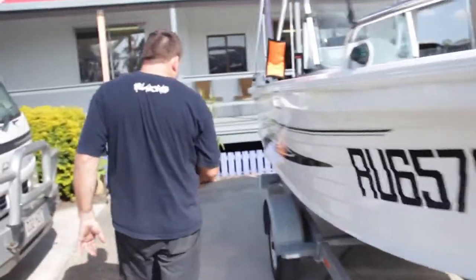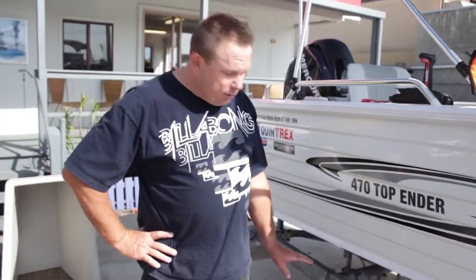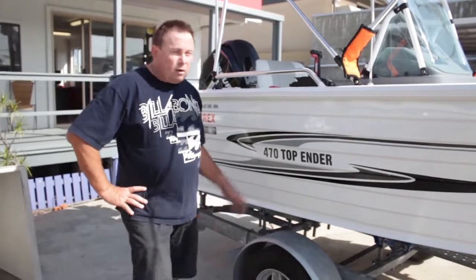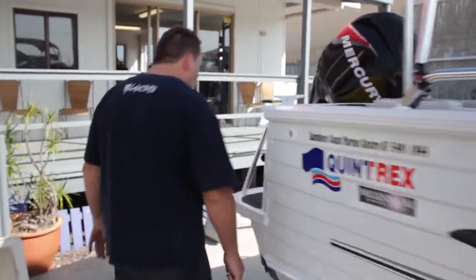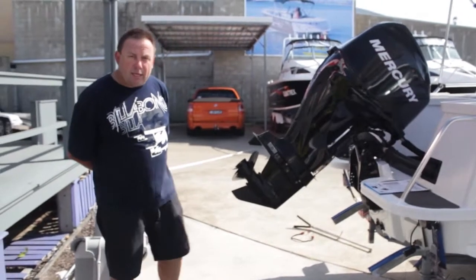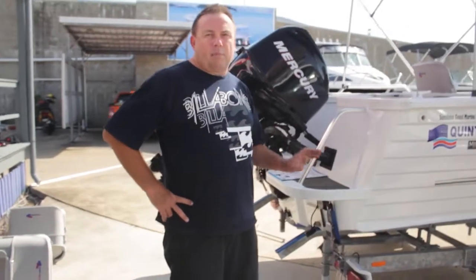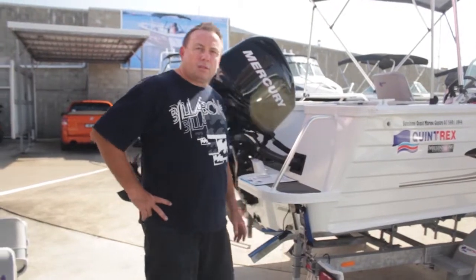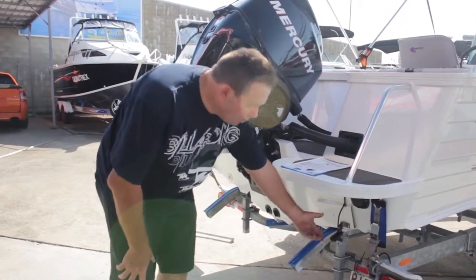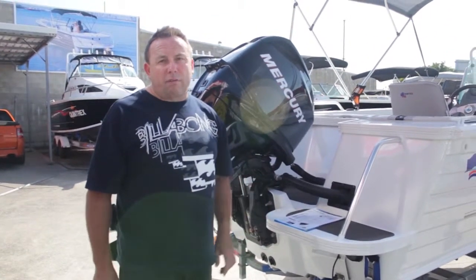Always make sure you've got good tyre pressure - around 50 psi in these light truck tyres on a braked trailer is a good indication. Always like to jack the trailer up and spin the wheel - if you can hear it noisy, the bearing needs to be replaced. Once hooked on, get the trailer lights fitted up. We've got a good set of LED lights here and I'd always check that my trailer lights are working correctly as required by law. We've got some tie down straps here to keep the boat on the trailer, supported nice and firm. You'll also see the transducer, which the sounder picks up the depth from - always want to be careful putting the boat on and off the trailer.